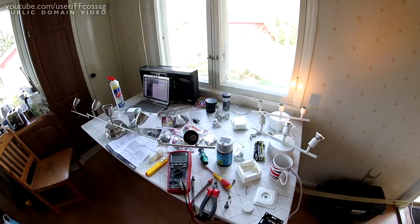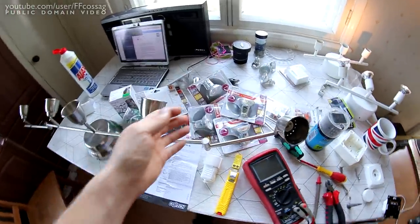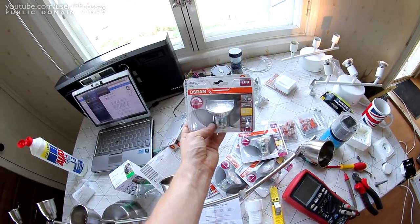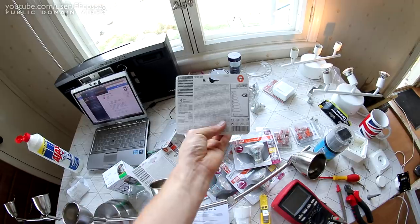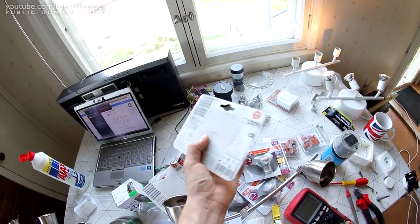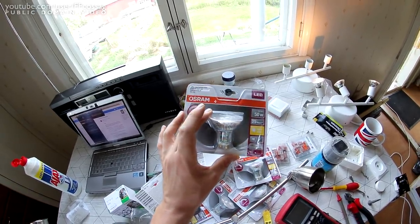That's not where I've spent the vast majority of my money, because I've actually splurged and purchased 12 of these dimmable OSRAM 5W — or 4.6W — LED bulbs. These are 350-lumen rated, so they're pretty decent light per watt, and they will put in way more light than I need.